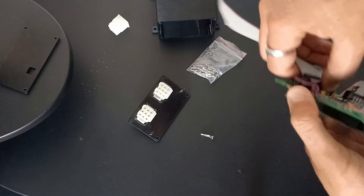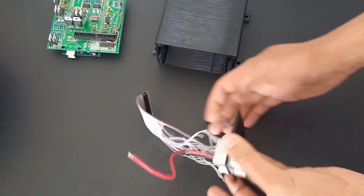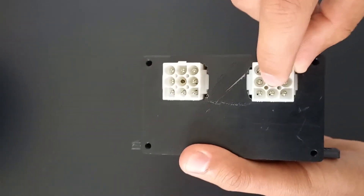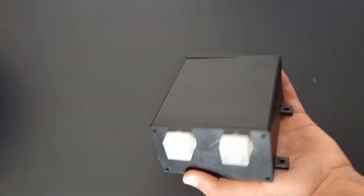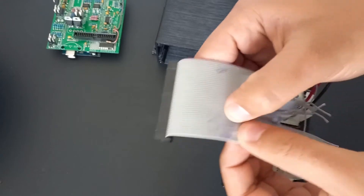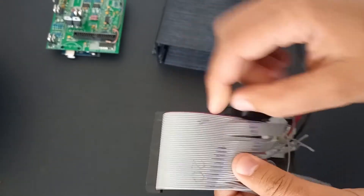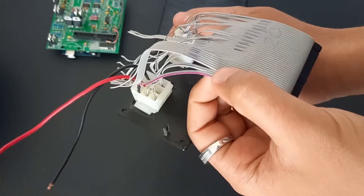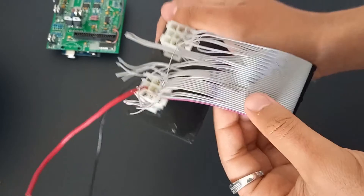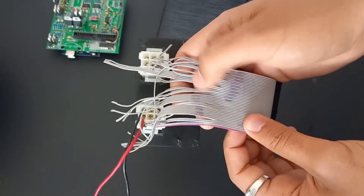I did the pinning off camera. I pinned a pin so the opposite plug can't plug into this one — that avoids shorting or using the wrong plug in the wrong location. The pin numbers oscillate between every second ribbon wire, so I marked them: the first purple wire is pin 1, the third wire is pin 2, the fifth is pin 3, and so on. I marked them from 1 to 20 and used the pin to keep count.